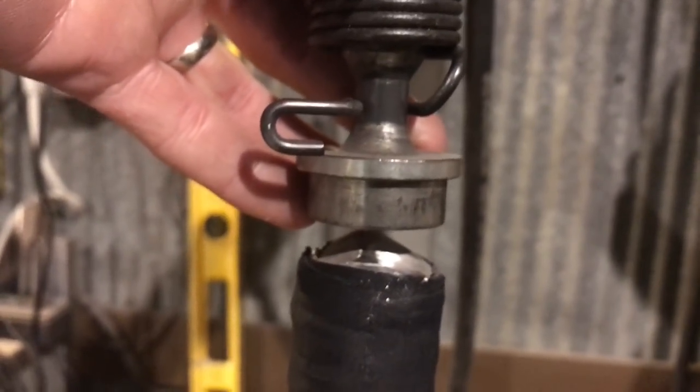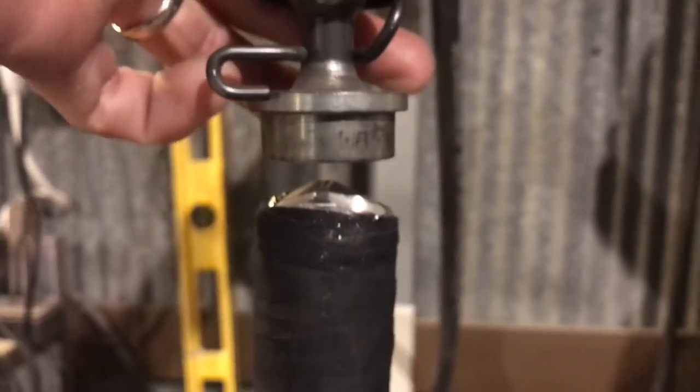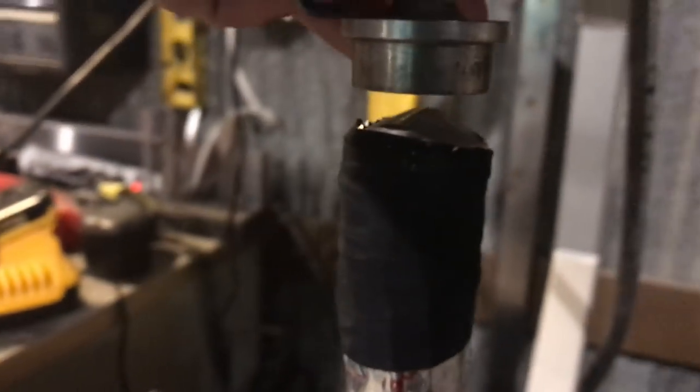The metal can go into itself or it goes away from itself. Into itself is when you're shrinking, obviously. But when you're pushing it away from itself, it's going to move that metal and create a shape — and that's what happens with linear stretching.